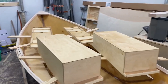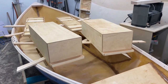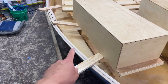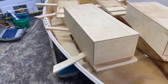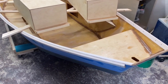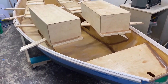We got some more progress on the boat. Here are the benches — I got them all sanded up yesterday and rounded over all the sharp corners. That turned out good. I also went through any of the unfinished wood in the boat — the side storage areas on both sides and the transom area — and put a coat of epoxy down to seal everything up so water isn't absorbed into it. All the plywood in the boat now has a coat of finish on it.